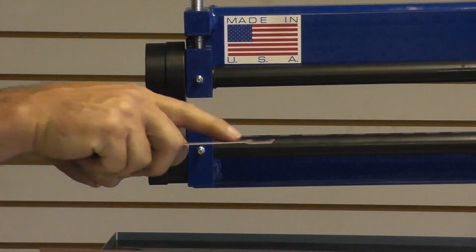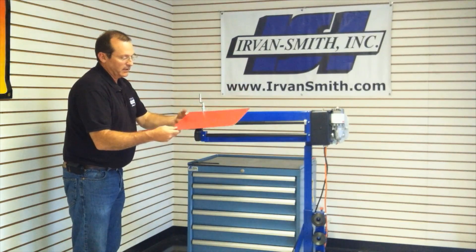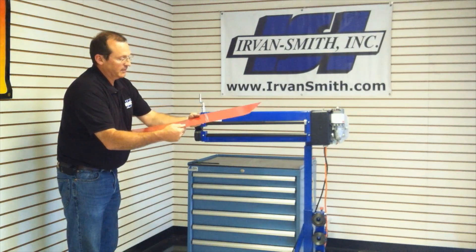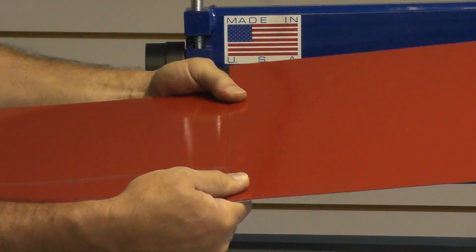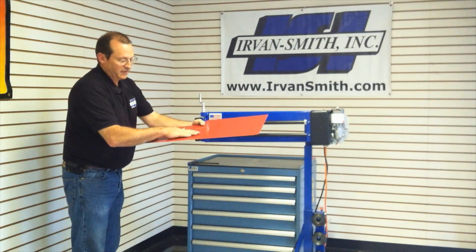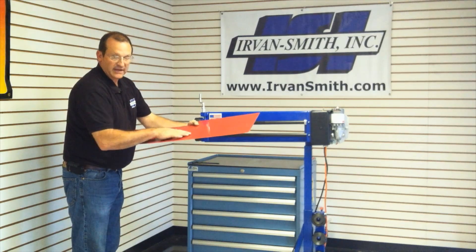So there's my finished step. If I wanted to lay another piece of aluminum in that step, I'd lay it just like that, put my rivets in. Now I've got more of a flush fit instead of it just being right on top, having that edge to catch.